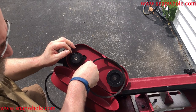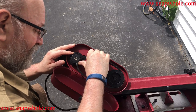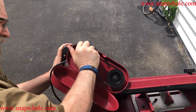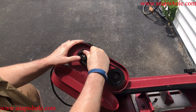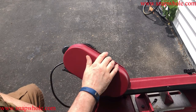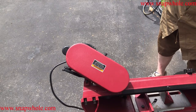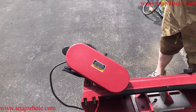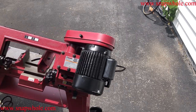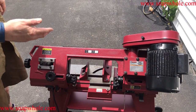The lid of this is the pulley arrangement to get specific speeds. Put the belt back on — I'm just going to put it on the lowest speed. Apparently you always want to go slow on a metal-cutting bandsaw; you don't want to heat up the blade. That's the final step for putting it together — you have to lift it up to engage the wheel.